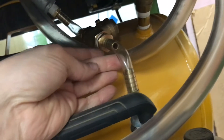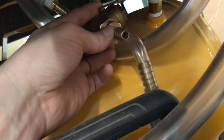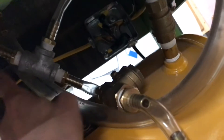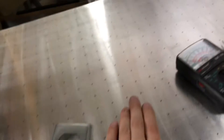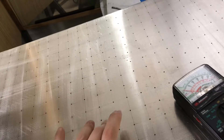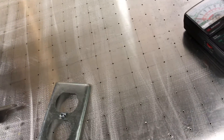I've got a line that goes from my pump to a T — or actually there's some kind of valve there, probably a check valve so air doesn't go back. Then there's a T that runs off to my gauge, and the other side goes to the tank. There's also a flange off the bottom of the forming bed. Inside I've got some kind of meshing or bar stock so if the suction is strong enough it won't pull the plywood flat.